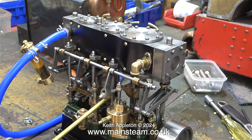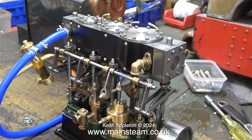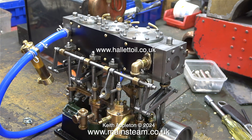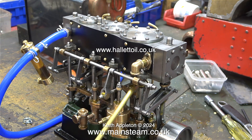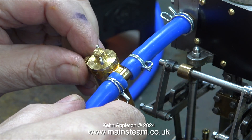While on the subject of lubrication — and I must say I've done this a lot in this series — I'm lubricating all the moving parts, and there are plenty of them. This, by the way, is not superheater steam oil for cylinders; it's general lubricating oil for steam engine bearings. I buy it from a company called Hallett Oils. At the moment I have some steam connected to the engine, and this is warming up the displacement lubricator, so now I can fill it a bit more.